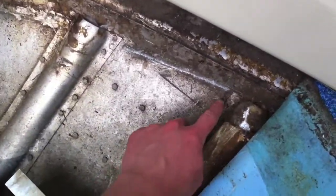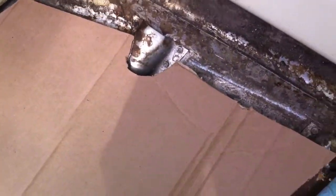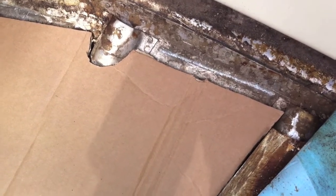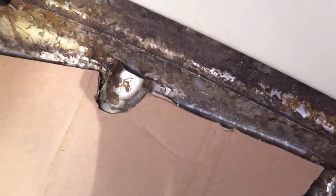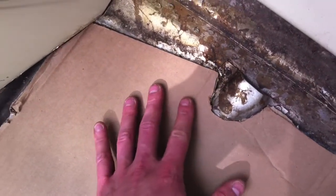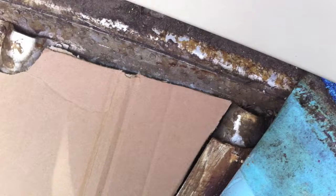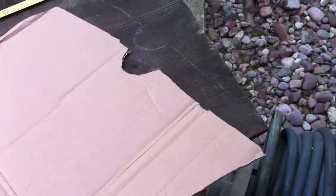Back to the floor - you can see this shiny line, that's the edge of the plywood that was here. I made a cardboard template that just fits in there, and I've cut my treated plywood piece to the square dimensions. But now I have to make the perfect radius to follow the boat because not all of it sits on the ribs. This is the template I'm going to use - it's 16 inches here to here, but the radius is custom.